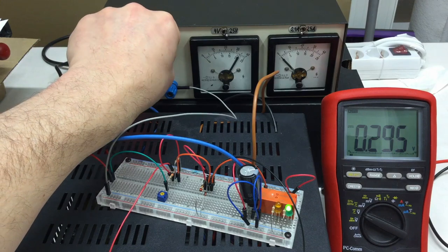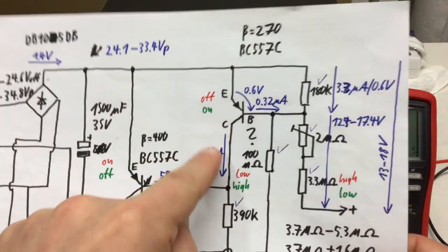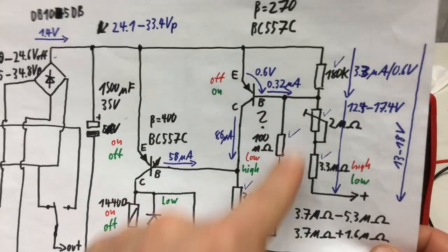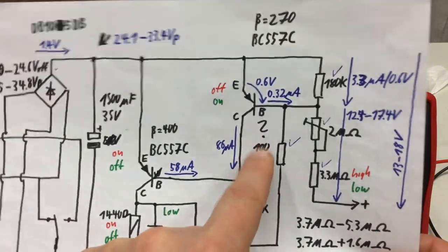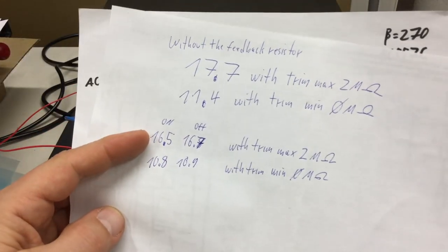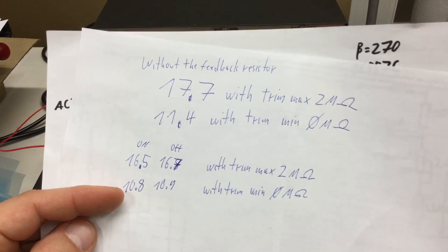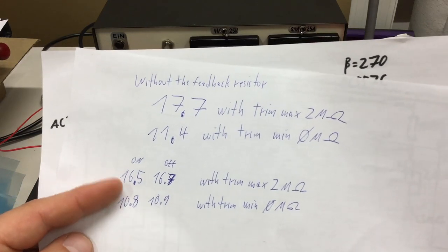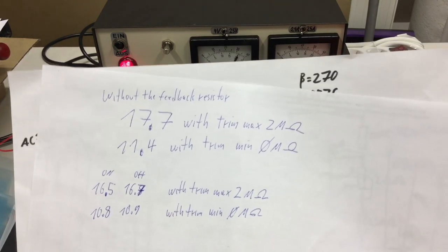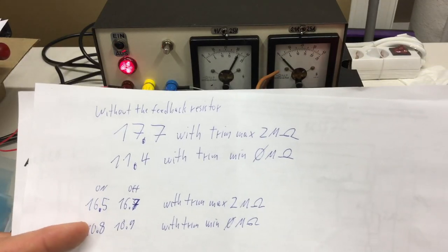But because it still changes here a little bit, that means that our sense transistor is not yet completely fully on, and that's also a sign that our positive feedback is not enough. So now we have between 200 and 100 millivolts hysteresis, and I wanted 1 volt. At least an order of magnitude, we could basically go down to 10 mega ohms. Let's be conservative and first go down to 50 mega ohms and try that again.